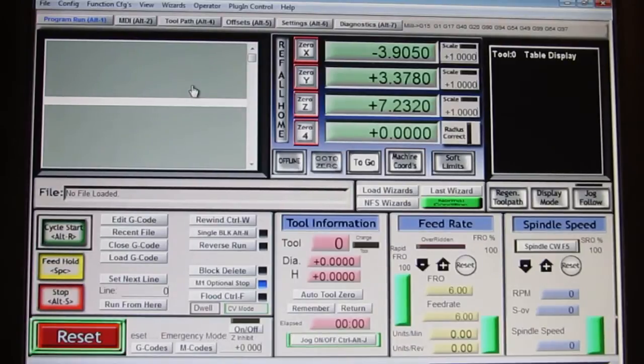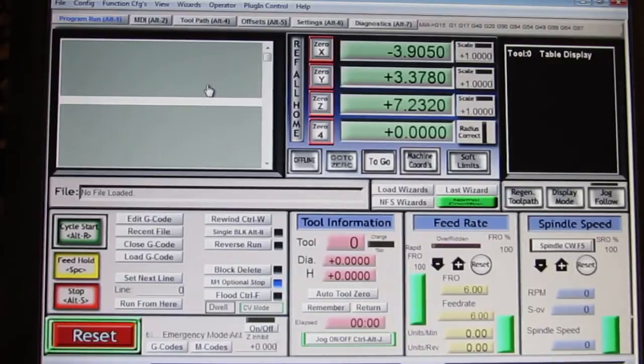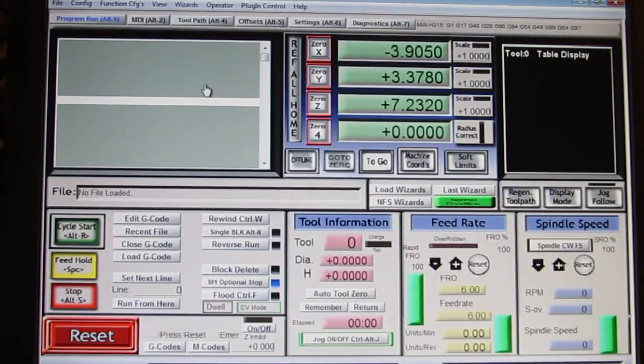So if you have a speed that's on the high side, and for something like this, by the way, I'll give you a little comparison here. My laser assembly, the head and the X and Y axis, the head that's being moved around is light in weight. It has no mass, and the motors can rapidly accelerate and decelerate. That's not a problem with my laser assembly. And they're only NEMA 17 motors. So I've got them up in speed pretty high. I forget what the numbers are. I'll put a comment in here to show you what the speed of the laser is. But one has to have a little bit of common sense about this to start with.